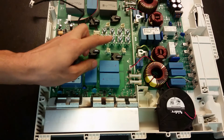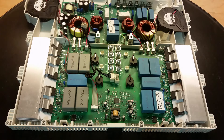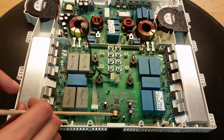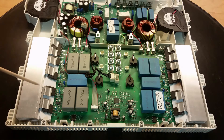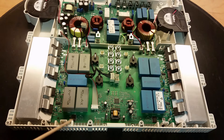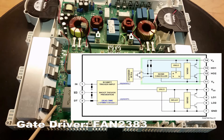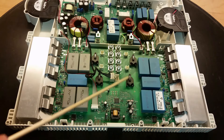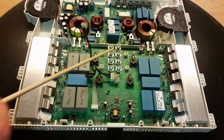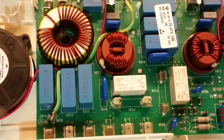Sadly this is blown. Maybe some capacitors are broken or maybe the inductor voltage is the cause. These should be IGBT transistors. This unit gets its power from the power supply up here, and this looks like some kind of isolated power supply for these two units. There are separators isolating the low-voltage electronics from the high-voltage electronics. Each channel drives one pair of IGBTs, and here you can see current transformers that sense how much current is going into the inductors to regulate it.